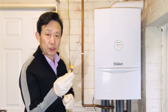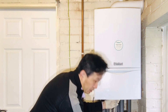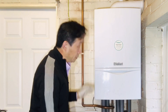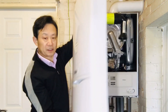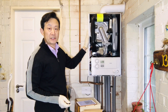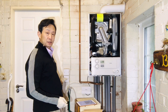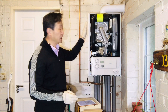Normally, what you do — you will have a twister. There is a screw underneath. You just remove this screw, which will allow you to open the front panel of the boiler. Because you have electrics inside, make sure you switch off the power here. It is safe for you to check your system.